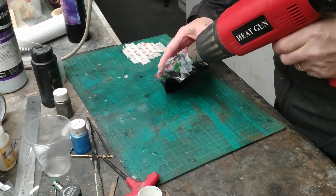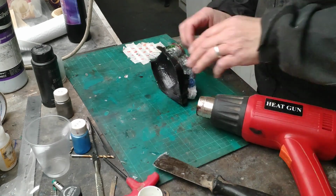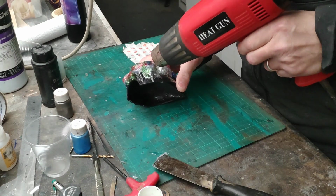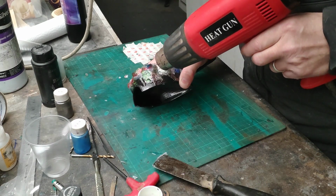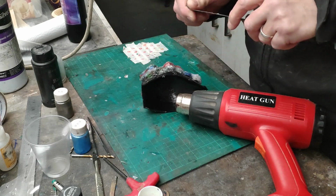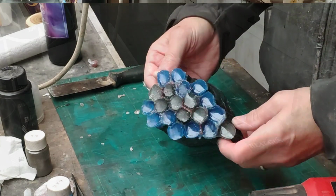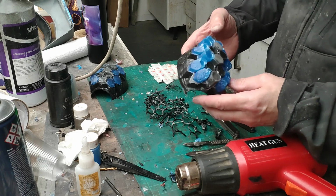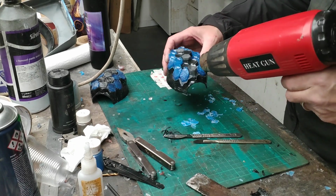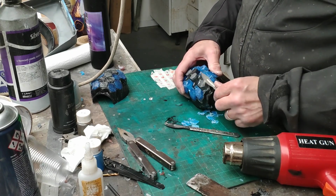The next day when the resin had cured, I removed all the hot glue, which was nearly as tiresome as applying it, but after an hour or so I had removed it all. For this one, I just heated the printed part until it went soft. I was then able to just pull it all away. The resin had to be trimmed down to the rough shape before finishing with a belt sander.